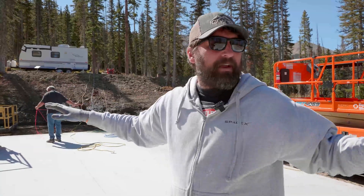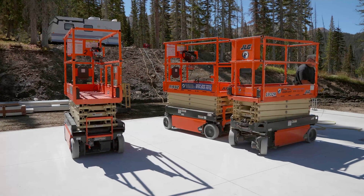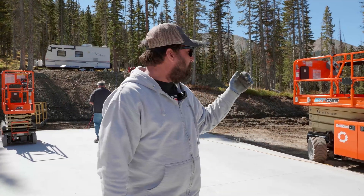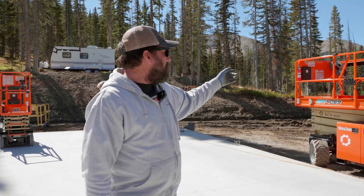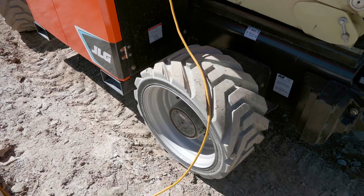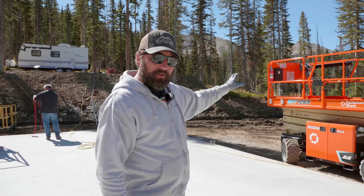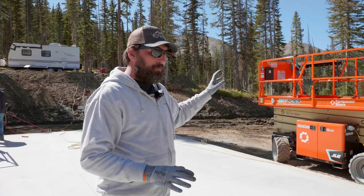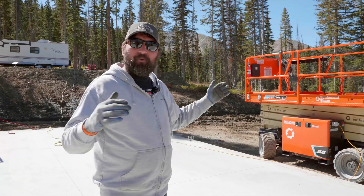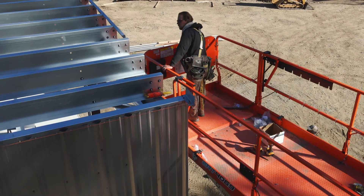When we're talking about job site prep, you can see this area is all flat and level all the way around the building because the slab has already been poured. We can use hard-wheeled lifts inside the building for hanging purlins and getting up into the rafters. When we go to sheet the building from the outside, we're going to need a rough-terrain telehandler or a man-basket boom — something that can go off-road. We have two options here: the rough-terrain telehandler or a scissor lift.